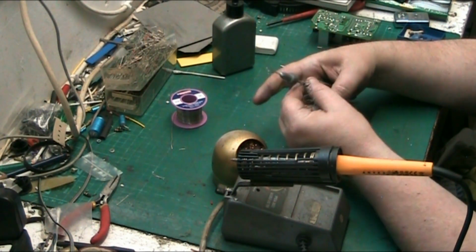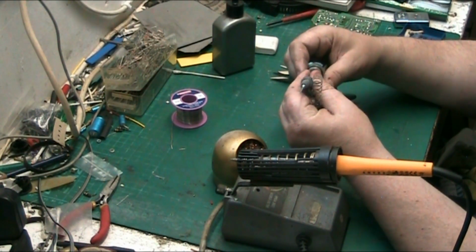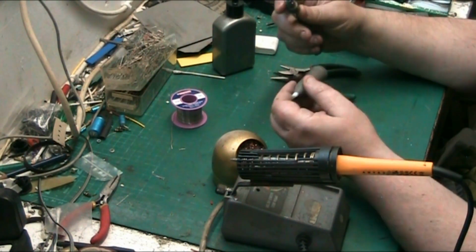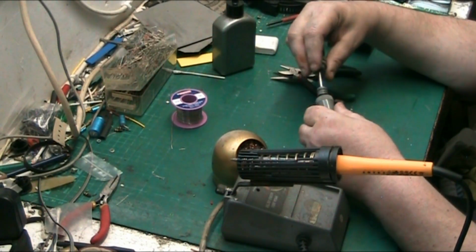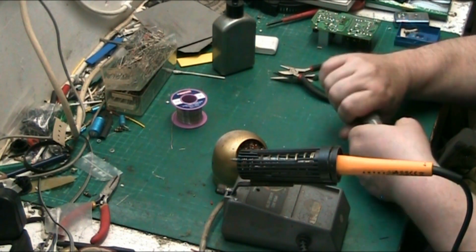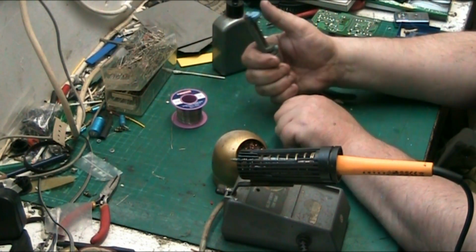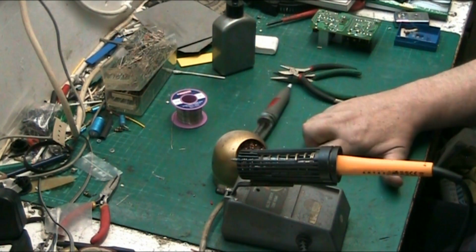Make sure that your pin on your sucker is clean, and make sure the shaft is clean. And your plunger, make sure that's clean, and make sure there's no debris in your O-rings, which there isn't. We're okay with that. And then all you do then is just put your spring onto your plunger, and you just insert it back into the body of the sucker, give it a tighten, not over tighten it, only a little bit is needed, there we go. And if you put your finger under it, press it down, put your thumb on it, and there. You can actually feel it pulling your skin a little bit if it's a good sucker. Anyway,